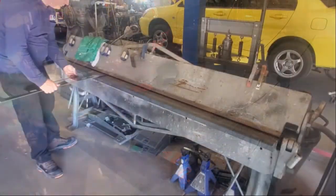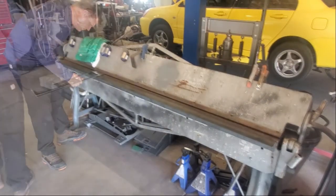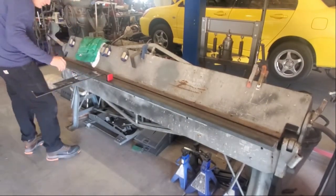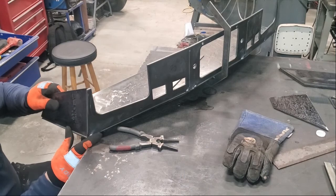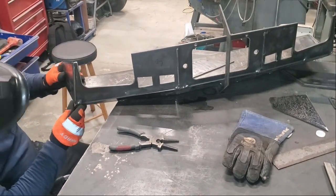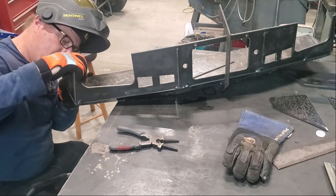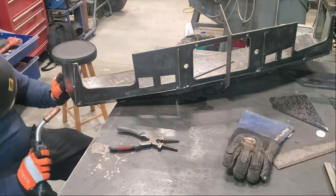What you're seeing now is the front plate of the bumper. It's 3/16, so even using a brake wouldn't normally give you a very good bend on this. But the Madden USA DXF file does include relief cuts in the front for easy bending — not just with a brake, but you can use a pair of channel locks or even a set of crescent wrenches and some clamps.